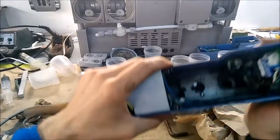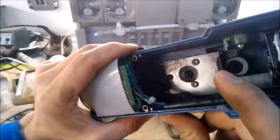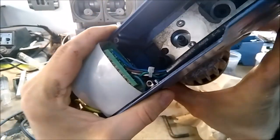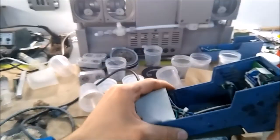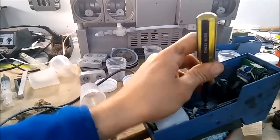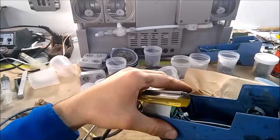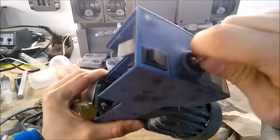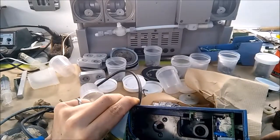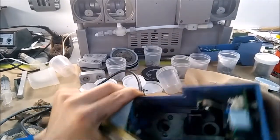That reveals three T15 screws which hold the motor on. This motor is actually moving freely, which is probably a hint as to how this is broken. I'm moving the motor all the way back. Typically you have to move it with a wrench, or if it's totally seized things get more complicated — I've had to do destructive removal and then replace the part.